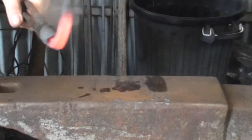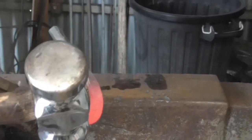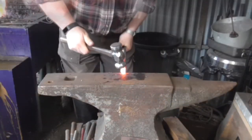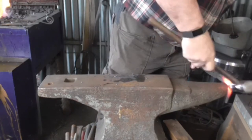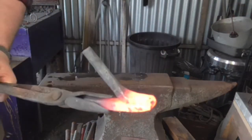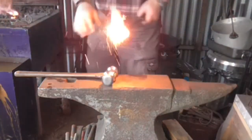Now the trick here — so I'm told — is to use the rounded face of the hammer to form a fold there. The next move is to faggot weld that fold. My fire struggles to get to weld heat, so we'll see how we get on with this.